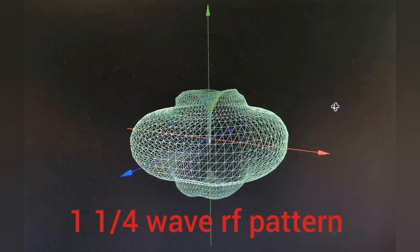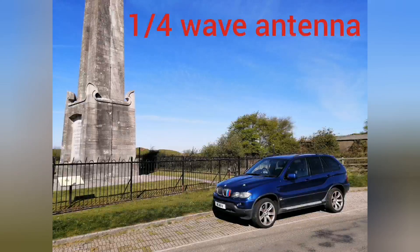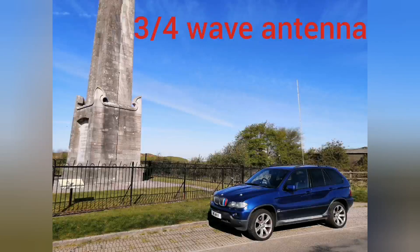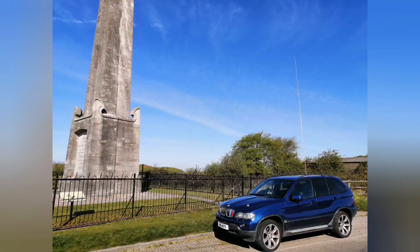Some may note that the actual lobes are not as prominent as the three quarter wave. This just proves you cannot beat the laws of physics - the antenna is over one wavelength long, so you've got to put more energy in to get less out. That is why a quarter wave antenna is such an efficient antenna. The quarter wave antenna was a standard pre-made one from a manufacturer. For the three quarter wave I used an MFJ1979 telescopic whip antenna, which extends to over 16 foot - extended to approximately 10 foot for three quarter wave on four meters. For the one and a quarter wave, the MFJ1979 was extended fully to about 16 foot 9 inches, giving a VSWR of 1:1 across the four meter band.